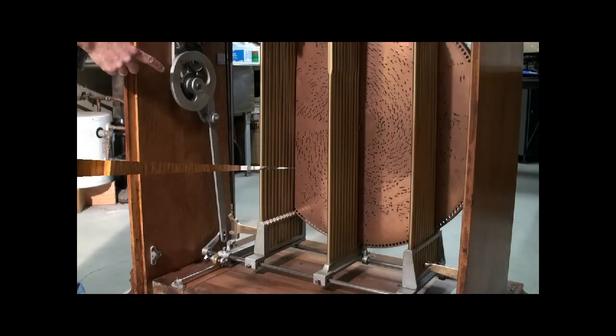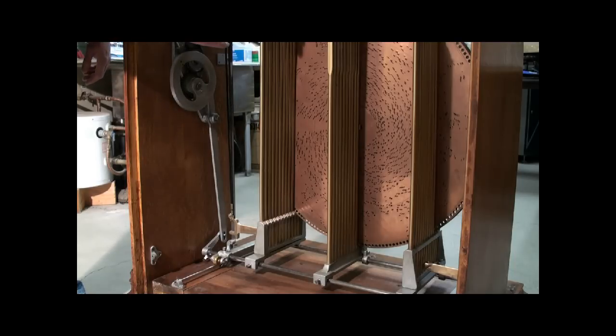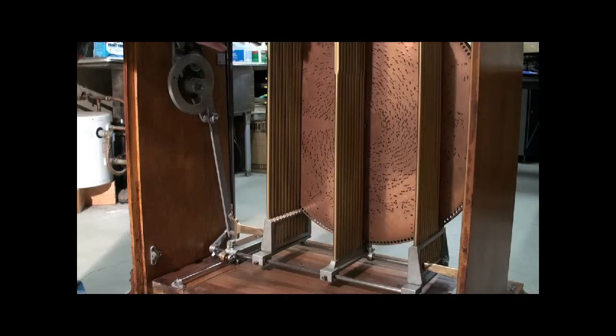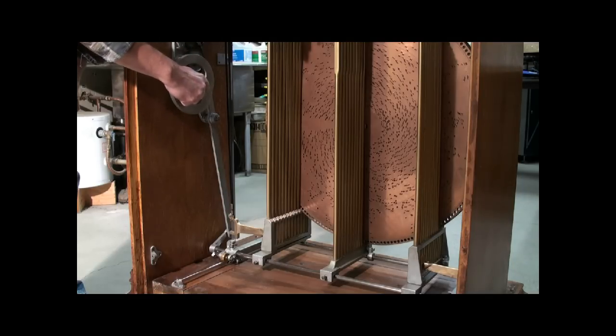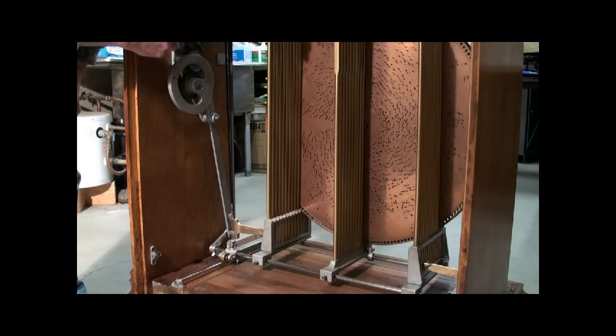And the heart-shaped cam turns circular motion into linear motion back and forth. So each time this is activated, it moves the disc carriage one increment, one disc forward. When it gets to the end of this heart or the indent and then starts back out, that's what causes the arm to reverse and move backwards in the opposite direction.